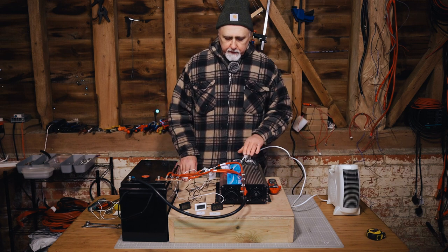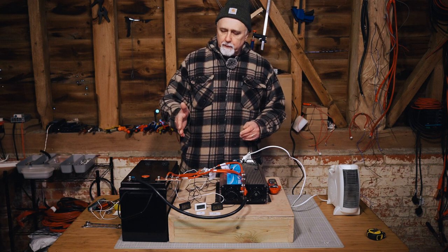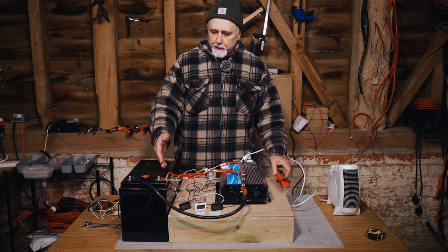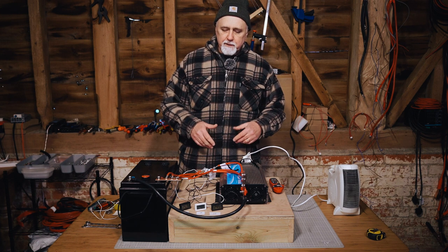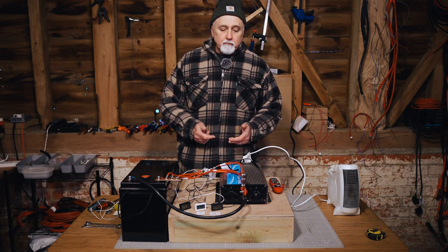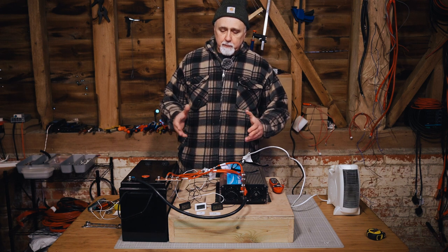We've been running this test for about 10 minutes now. As you can see, there is slightly more heat on the 4 Nm connection, but still not a material difference. Final conclusions: we are running roughly 170 to 180 amps through here, which is being split quite evenly between the three cables as we saw using the clamp meter. That means each connection is carrying about 60 amps, and what we can see is that the difference in torque is really not affecting heat buildup with something as low as 60 amps. 60 amps is not a small amount of current, but it's really not that big either. With our enclosed batteries, 100 amp continuous is the sort of sweet spot where you don't get heat buildup within the enclosed battery.